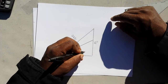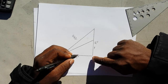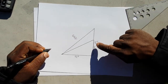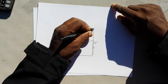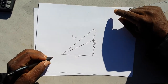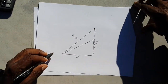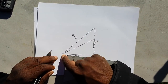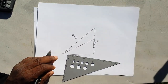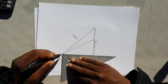So we're going to write 7 inches for this space right here, from here to here. All right, we'll put a little bracket here. All right, and 12 inches is this one here. So we write another bracket, a larger bracket, and it dovetails into that one. Okay, so this is 12-12, this is 12 inches, and this is 7 inches. Now watch this. You can see right away that from ground zero, the beginning point, this is where both of those marks meet. But the further you go out, the wider it gets. That is very key. This is one of the reasons why guys can't line their rafters up, because they don't understand this concept. They don't have a clear view of this.